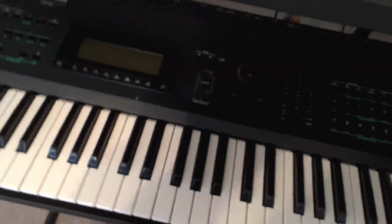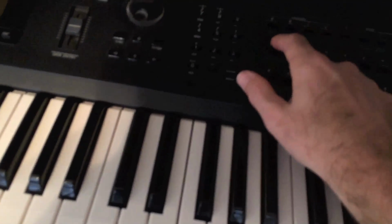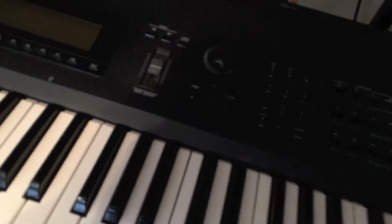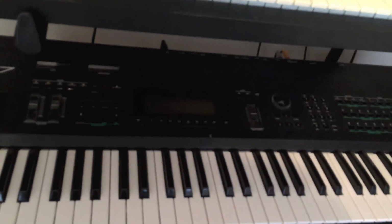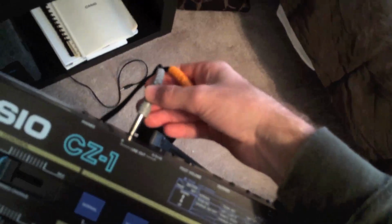And the last thing you get to, of course, is this top panel. So you take that off and you have all these little tact switches, and I really didn't expect it to work, but I just sprayed the hell out of them, you know, worked them real good, and the next day they worked fine, all of them. It fixed it. So it can take a little bit of time. I remember that it didn't work immediately, but it's a little bit harder to work a relay than it is a button.